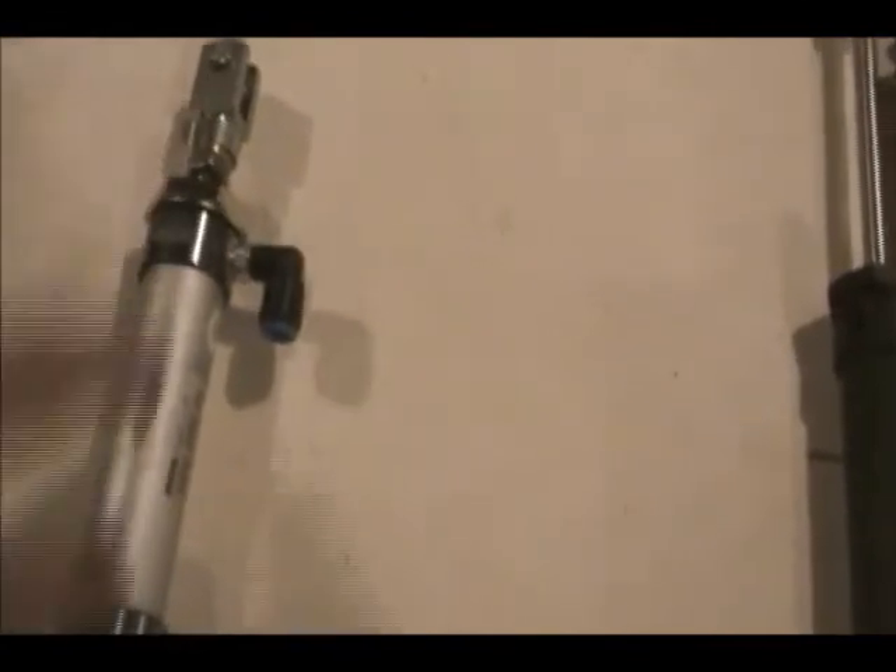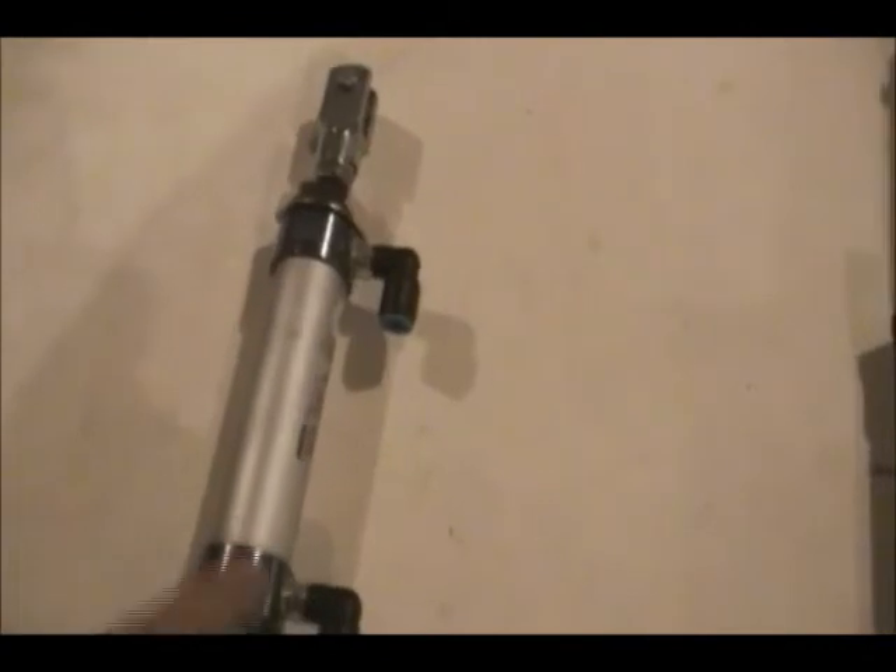If this was a single-acting cylinder, it would have a spring typically on the retracted side. Air comes in here, extends the ram, and then when the air exhausts, the spring pushes the ram back in. This is what I use in my pneumatic groundbreaker, one on each arm. These are the same fittings that the quarter-inch green hose goes into. I use elbow ones so I can snake the hose down — straight fittings are pretty stiff. If you're concerned about that, always go for elbow fittings. They're a little more expensive but well worth it.